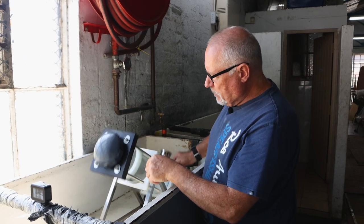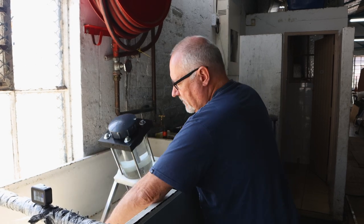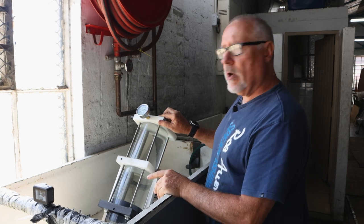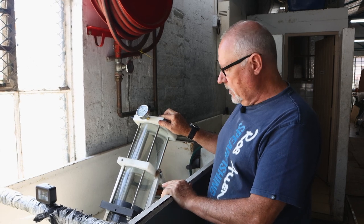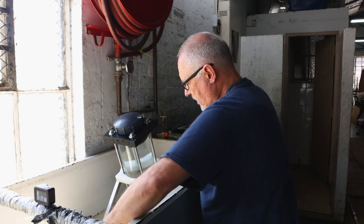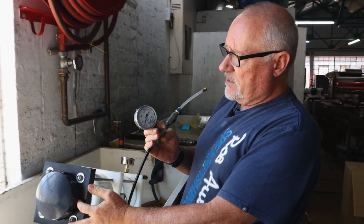There's a sealed lid that goes on with an attachment point inside for torches and housings to be set. What I want to do now is test that it can hold the pressure — we're going to take it up to about two and a half bar, but we'll only work it at about two bar. At the moment there's only water in it, very little air. As you know, we've used this device in the past for testing floats.